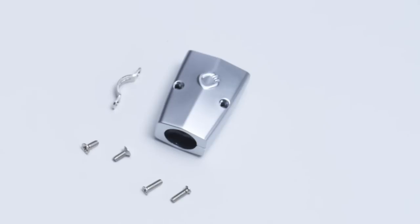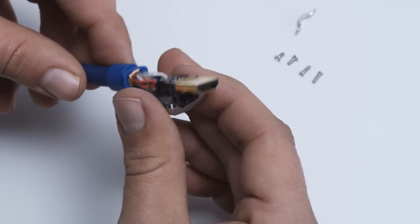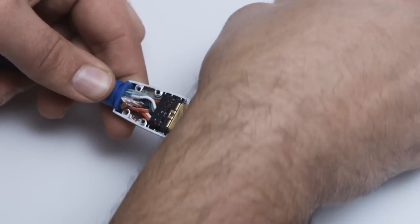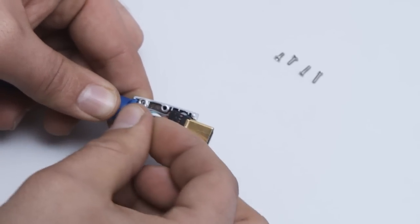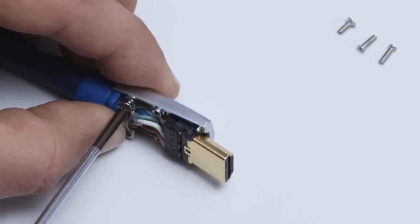Take the base part of the casing from the bag with logo number 5. Insert the assembled inner part into the casing. Place the circuit group of the shielding braid under the traction relief so that there is optimum contact to the metal parts of the connector casing. Use the enclosed short screws in order to attach the traction relief.